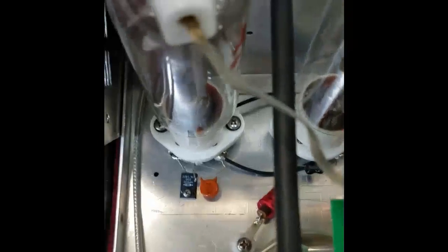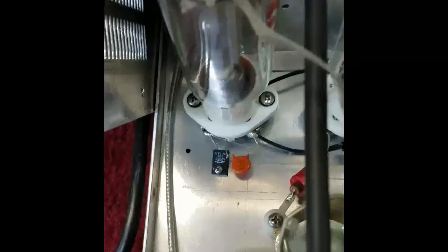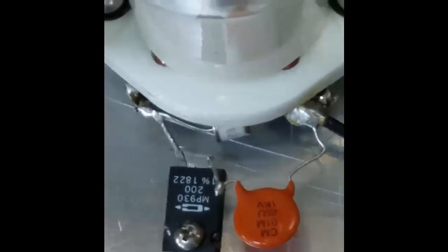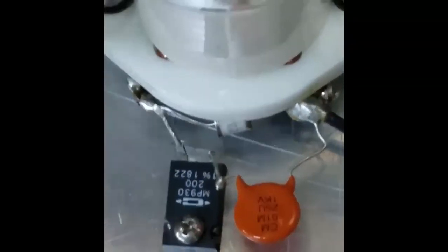What I'm going to do is go inside the amplifier. It has a little cathode resistor shunting the cathode — a 200-ohm resistor — and that's to make up for the missing tube. So the drive power of this amplifier more closely matches the AL-811H. This little 200-ohm resistor kind of replaces the missing tube so the drive power is about the same. It also helps stabilize the amplifier a little bit on 10 meters.